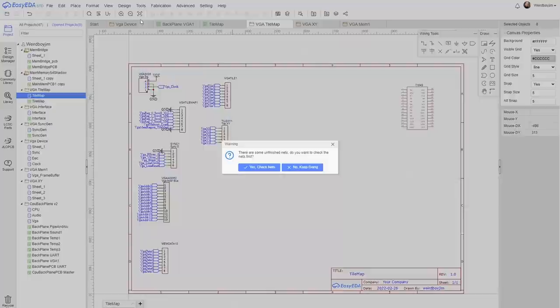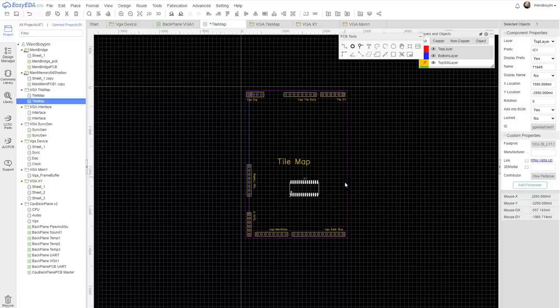The frame buffer of a tile map needs the registers to store the scroll offset, it needs the memory chip, and then it needs the XY counters and the appropriate logic chips to mediate the XY counters and the address bus to actually handle the addressing into the memory chip. Now, I'm already thinking that this is going to be very tight, but let's see what we can do.